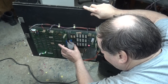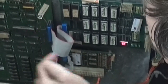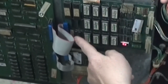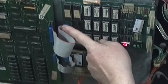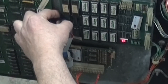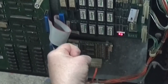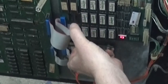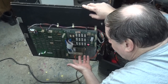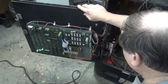I want to give you a little tip. Do you see this side of the ribbon cable? That's the plug that goes into the board, but this flap right here grips the ribbon cable, and there's all these little steel fingers in there. We find that over the years that connector's plastic warps a bit. So sometimes just taking a gentle squeeze with a pair of pliers along the edge of this, while you have the board on your workbench, will get a nice firm grip on the ribbon cable again. I suggest doing this only if you're having intermittent problems. But we do this automatically because this game is getting shipped a long way, so we want to make sure there's no problems.